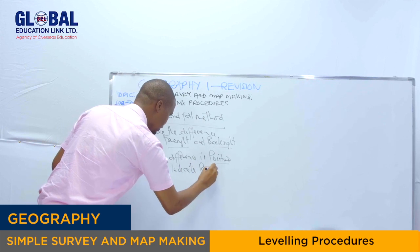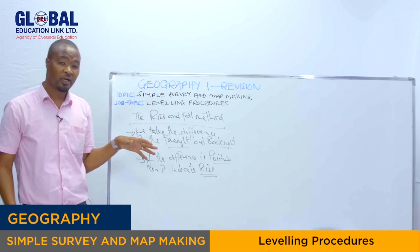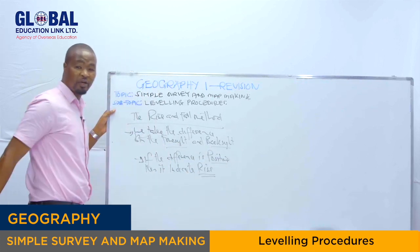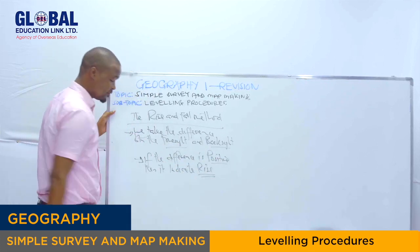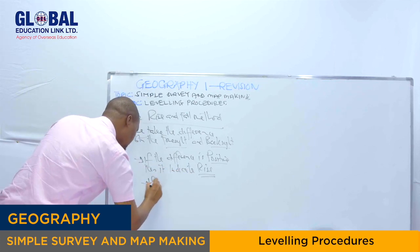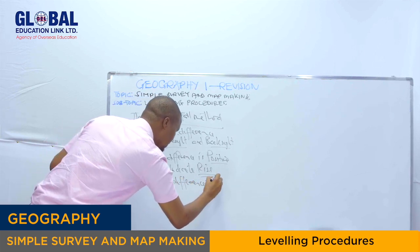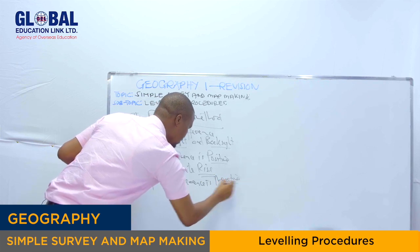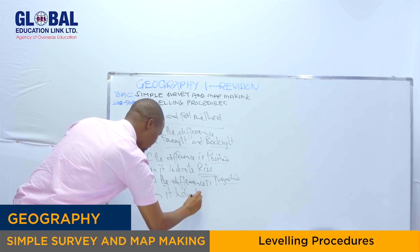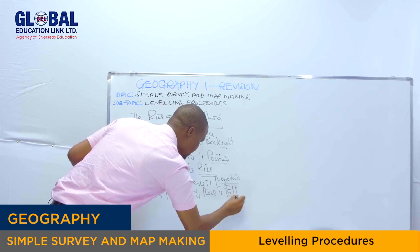So in this method, if you want to know if there is a rise or fall between the two points, we have to take the difference between the foresight reading and the backsight reading. If the difference is positive, then it indicates there is a rise between the two points. But if the difference is negative, it indicates there is a fall between the two points.